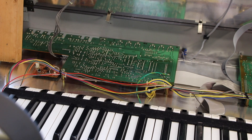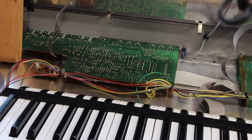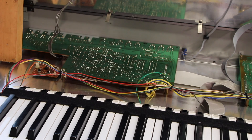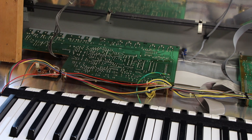This is a great little device — I can turn the intensity up or down and turn it off. Normally it sits on a stand on the bench, holding over the work. Using this magnifying glass and going over joints, I can see very clearly which joints are good and which aren't. At this point, now that you've looked at the circuit boards and tried to eliminate dry joints — and you'd be surprised how much damage a dry joint can actually do — the next thing is to start looking for signs of damage. I'm not just talking about breaks in the circuit board, though there could be those too. When you go over the circuit board with the magnifying glass, follow the tracks across to see if any tracks are actually damaged.